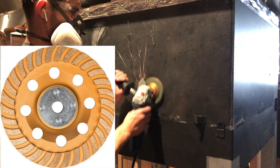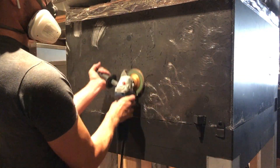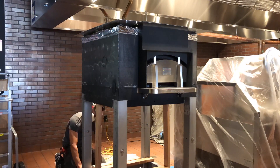As for the metal oven itself, I wanted to abrade the surface so we had proper adhesion once we apply the hardy board. I'm using a diamond wheel on my grinder just to abrade all the metal surfaces that I can so I have proper adhesion afterwards.